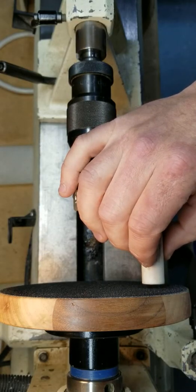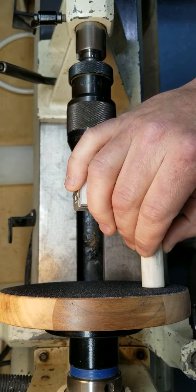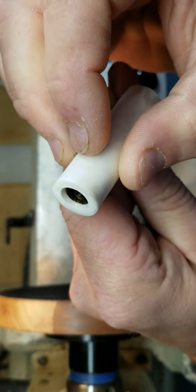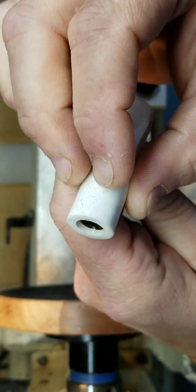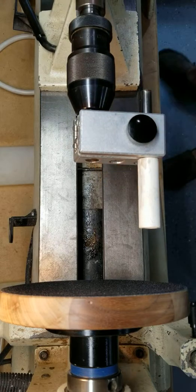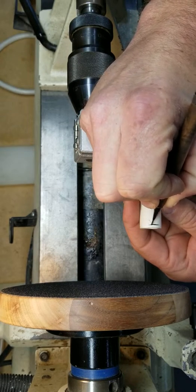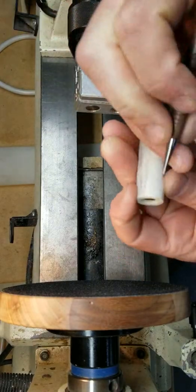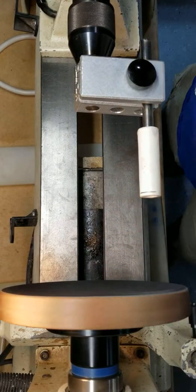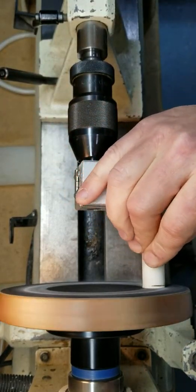There will be a difference in sound from the material you're sanding until it hits that brass tube. Over time and experience you will learn to notice that sound difference. If it's not something you can hear very well, you can just bring it up, take it off, and check it. We can see right here there is approximately three thirty-seconds of an inch showing before the tube. You can mark a line roughly right here so you have an idea of when to start checking.